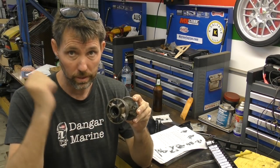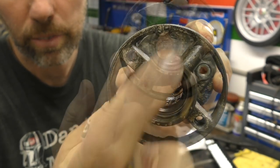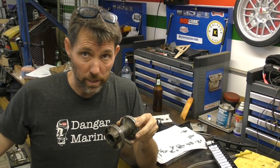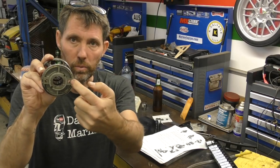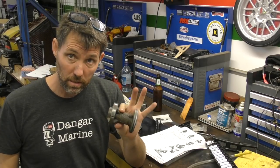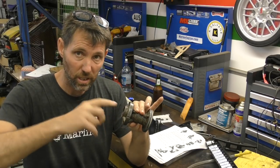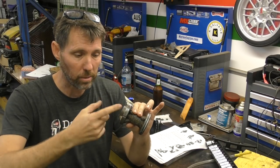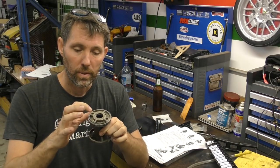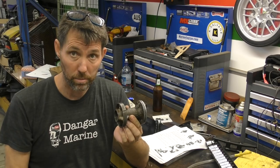On the aft end of the bearing carrier — the one that points out of the gearbox — you'll see it's got a little 'up' written, so this is what goes to the top. The holes at the back are what we're lining up with the retainer plate, and we're going to slide it on with the left hand guide pin coming in through there. Before we slide it on though, I'm just going to put a little bit of grease on the inner lips of the oil seals so it slides over the gear shaft and has a little bit of startup lubrication before the gearbox oil works its way through. So: reverse thrust washer, new o-ring, bit of grease, bit of grease on the oil seals — time to press it in.